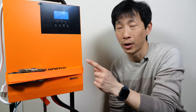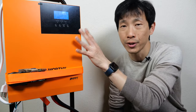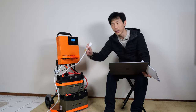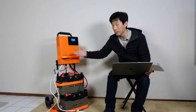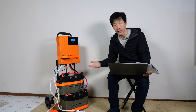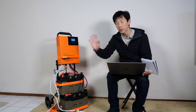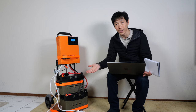One of the more difficult things is to set up all the parameters within this hybrid inverter. Let me show you all the parameters I've set up. This hybrid inverter has over 28 parameters when you set it on lithium iron phosphate battery. When you use energy from this hybrid inverter, it needs to know if it wants to take energy from the AC input from the wall, from the battery, or the solar inputs. Similarly, when it charges, should it only take energy from the solar or the AC input? Each of those are separate settings.